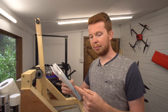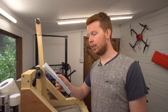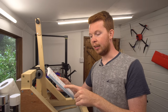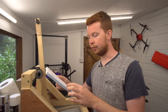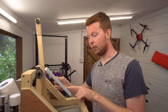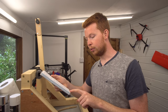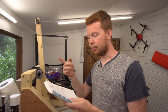Basically, I've made a list of all the variables involved in trying to get the boomerang to come back to the launcher. These are just a few that I've got on my list. These include wind direction, wind speed, air humidity, thermal lift, boomerang shape, boomerang weight, boomerang dihedral or anhedral, the boomerang blade aerofoil, the boomerang blade angle of attack, the boomerang spin rate, the forward launch velocity, the drag of the boomerang, the differential in blade lift, the launcher torsion, the launcher movement and release angle. So those are just 16 variables I could come up with really quickly.